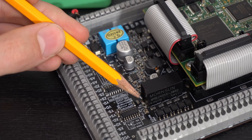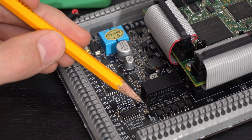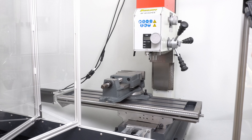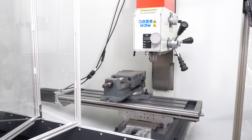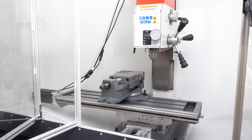To show how tiny these parts really are, I'm going to insert a picture I took with the super macro mode on my OnePlus 7T — which is becoming my new favorite mode for debugging. This thing is so tiny I'm almost proud of myself that I managed to solder the resistor back in. Now I have to either find a replacement for this TVS diode or figure out if it's safe to operate the circuit without it. With it removed, the board should work again as it was supposed to.